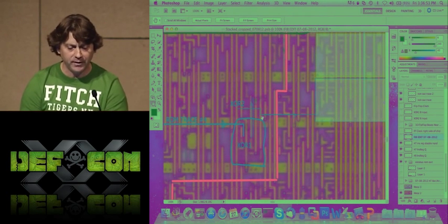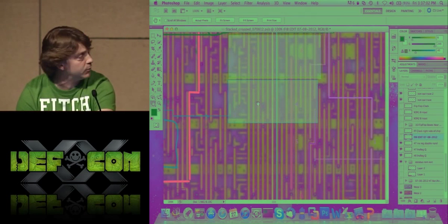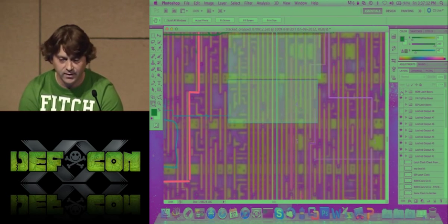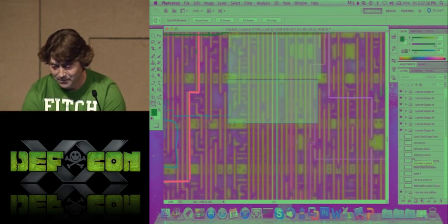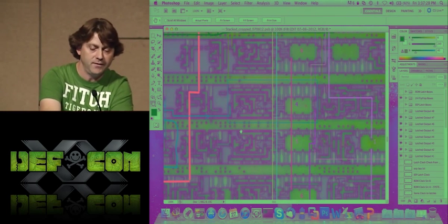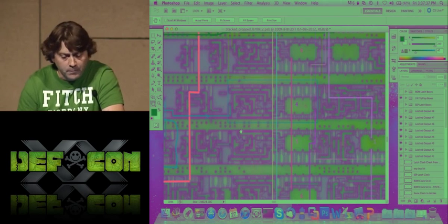So the output of XOR 2 came over and it plugged into this here. I have it labeled number 4, where my mouse is, this box. And I can turn the boxes off, but I think they actually help. Is it easier with the boxes lit up or with them off? Okay, I'll leave them on. So when we shrink down, actually I'll turn them off because you can't see now. So the decrypted value, re-encrypted again, feeds into this tri-state that I labeled number 4. And I don't know if this is truly bit 4 or not, but I have to label them in some order that I can deduce, that I can tell the difference for now.